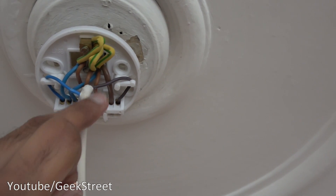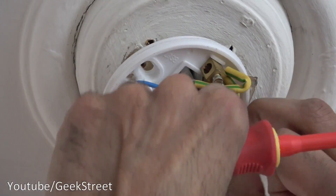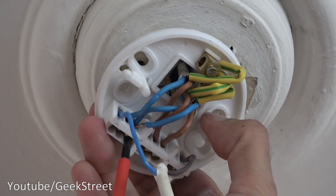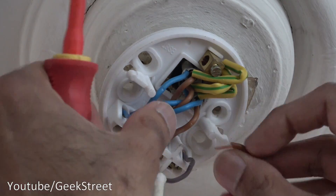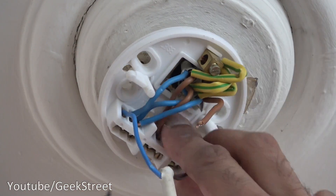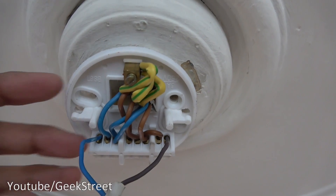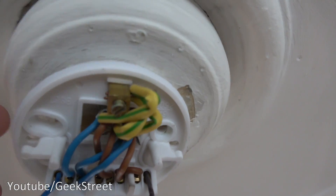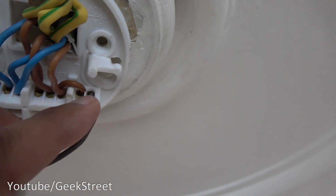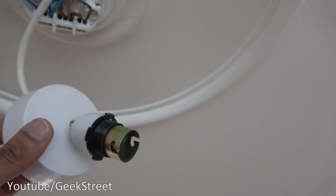So let me make a start with this. I'm going to unscrew this wire, take the sleeving off, move it over to neutral, and put this cable in so it's permanently live. Wiring is completed and you can see the neutral wire has been switched over from that position to over here — it's going into a single connector block — and I've got a cable crossing over to provide live on the ceiling rose cable. This is now ready to have a smart bulb connected to it.